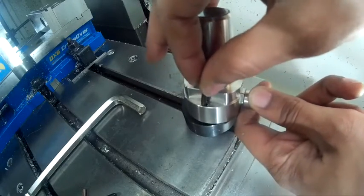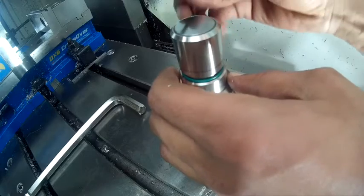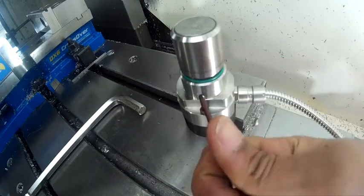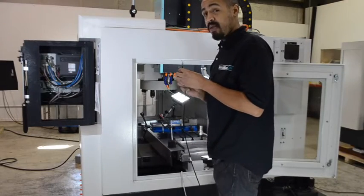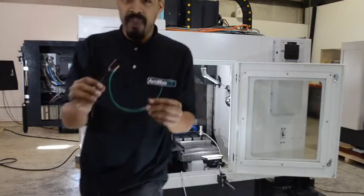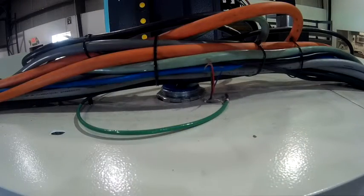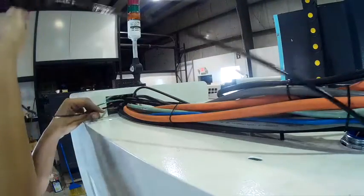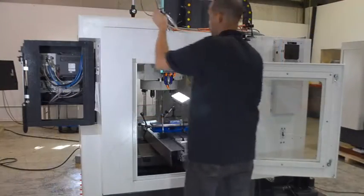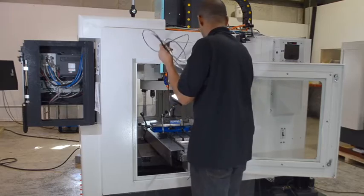Now I want to put my screw in there, line it up, and use my Allen wrench to get it nice and tight. Now I've got my placement for my tool height setter. I'm going to feed the wires through the top of the machine. I've attached a small wire to extend our ground for when we get inside of the controller. Make sure to leave a decent amount of leeway so that your wire isn't too tight, so that if the table moves your wire doesn't get pulled in a drastic way.